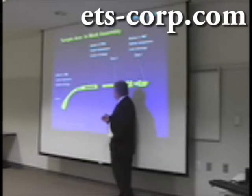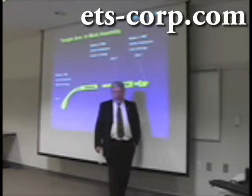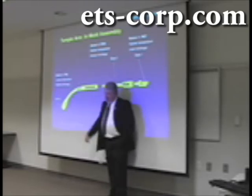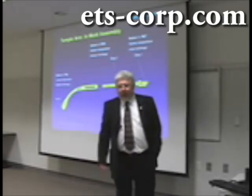Then the tool opens again, rotates again, and the last component is molded in the same tool in a different cavity, which is the TPE material. This TPE material has the highest shrinkage and the lowest molding temperature.